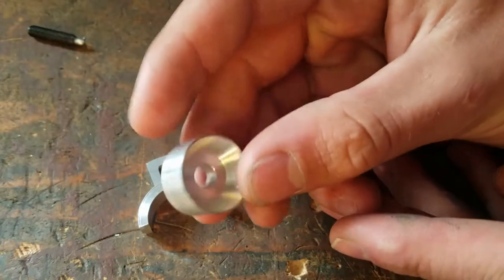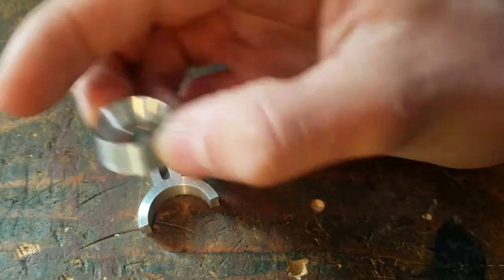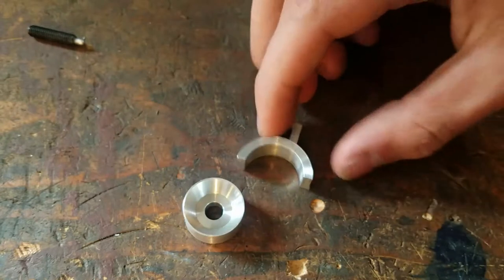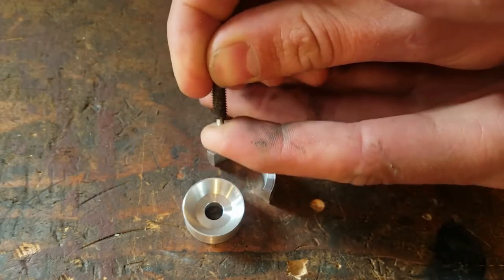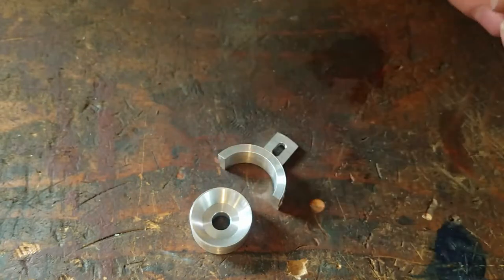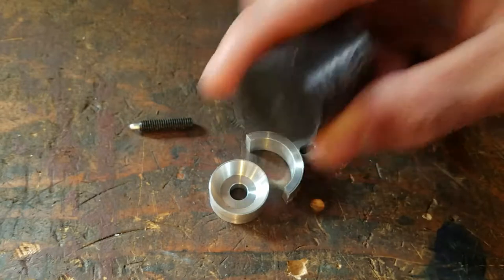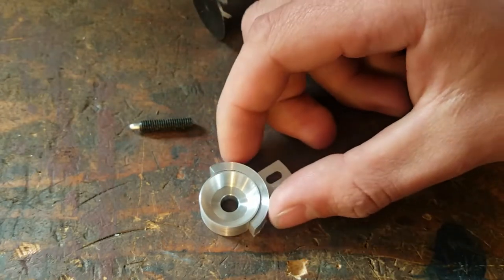I thought I would do a follow-up on this lathe project — I realized I didn't really explain what this is for. I'm working on a fly reel right now and this is going to be the brake mechanism, or drag mechanism. I've been working on this part and I still need to file the outside. I'm going to set it up so this can be actuated upon using this little spring-loaded set screw, and I'll have this pressing against what will be the shoe of the brake. This can slide forward, and it will be attached hard to the main shaft of the fly reel. I'm probably going to take this piece of Delrin and make it the pad of the brake that fits in there.